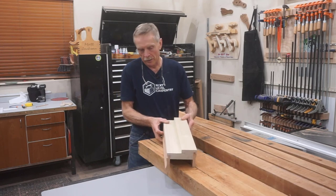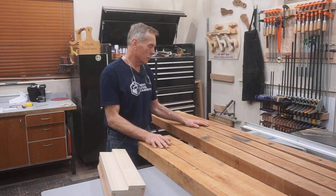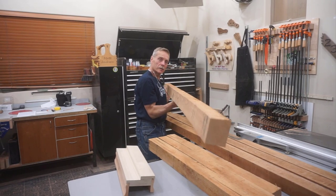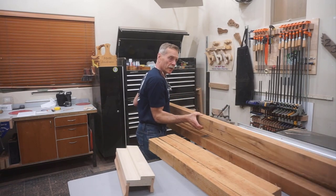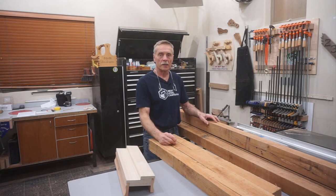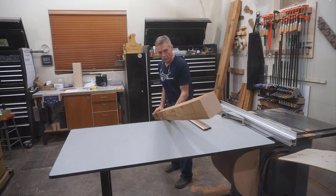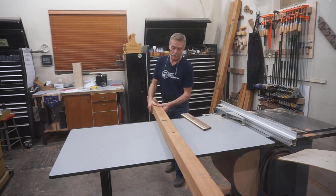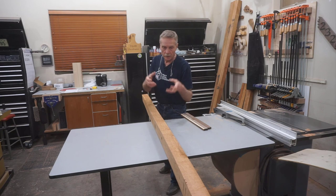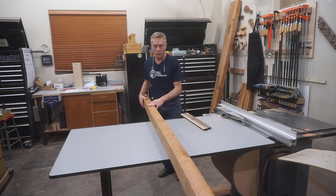And because I'm covering this part of the door build in the episode format, I think I'll take a little time and go into what it takes to get a piece of lumber like this that's rough in every aspect and turn it into something that I can rely on that's going to be consistent and accurate for a door frame. This poor piece of cherry here has about every malady that a piece of wood can have. It's got severe checking in it. It's deformed because of the unequal drying process. This is the center of the cherry tree here. That always causes instability.